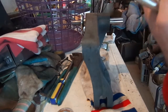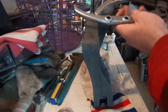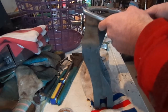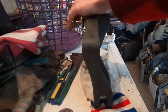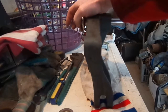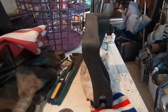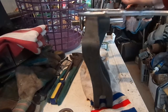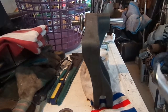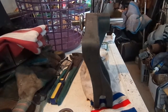So first I pulled the bearing on like so. I had this on the shaft right here, and I slid my bearing on, and put the washer over it, and then I took the 2-jawed puller, and as I said, because it's long enough, I was able to just pull it right on, and it was great. It pulled on with hand torquing. I was able to turn this bolt by hand and pull the bearing on, because I froze it overnight.